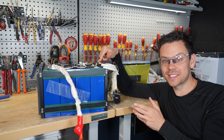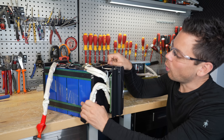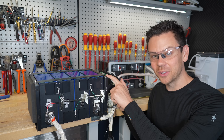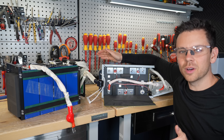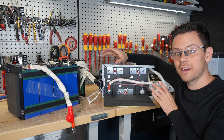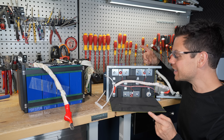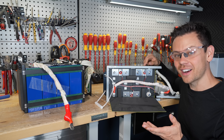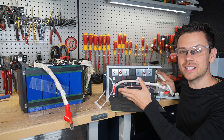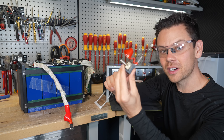This company just released a UL-listed battery certified under California standards, so seeing wires going through a steel hole without a grommet was pretty disappointing. The durability and metal cell holders are a plus. Regarding the Vatier — I like this design, and if they could lower the price with the same build quality they would absolutely dominate. But the Vatier doesn't have overcurrent protection — I almost forgot. No matter how nice it looks, it's missing a key safety feature. If you use one of these, you need to add a terminal fuse. These are cheap and very good insurance for Chinese batteries.